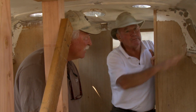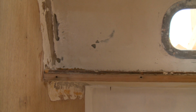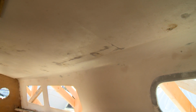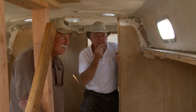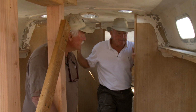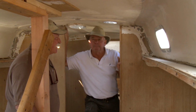Right. And we still have a few things on the list to go. I can see up here we were going to bond the shelf in, and we've talked about doing coring on that to stiffen this panel up, which I was concerned about, especially at the large windows being seaworthy. I thought they were flexing, and that's one of the reasons we were getting window leaks. So I see that still needs to be done, but a lot of that work and the hull to deck joint all the way fore and aft is easier to do when it's upside down. So that's another benefit of trying to roll the boat over. Yeah, there's a lot of upside down laminating that we'll be doing. And this area we just ran out of time on it basically.